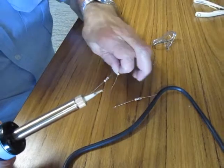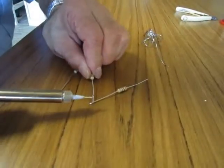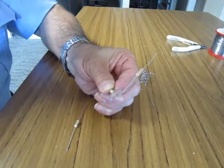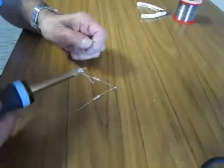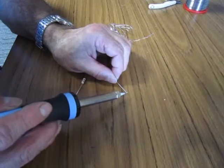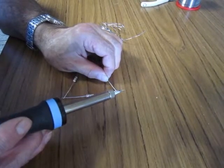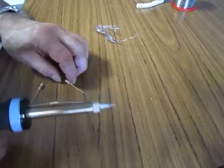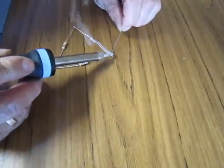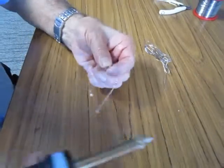The next thing you want to do is the soldering — just a little bit of solder. In this case, if you want a triangle, because both of them are already tinned and have solder on them already, you should be able to just join them together like such. Put some solder onto the tip because the other parts are already tinned, which should make it easier to solder together. Bring it close together to where you want it and there's your triangle.